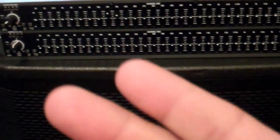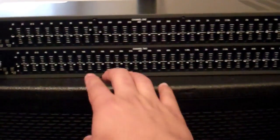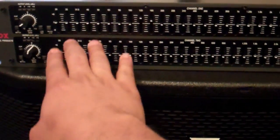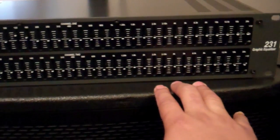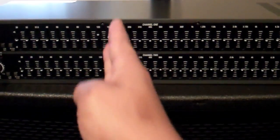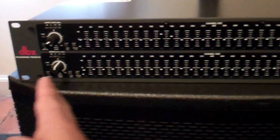In terms of how it would be on speakers, say for example you got an equalizer — sub bass notes usually happen around 80 Hz and below. So all of this would be your sub, and then your mids, and then your highs. What you want to try to do with a crossover is get them at a point where the tops are doing that amount of work and the sub is doing that amount of work.